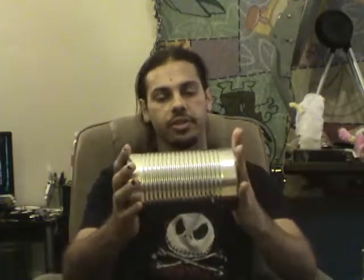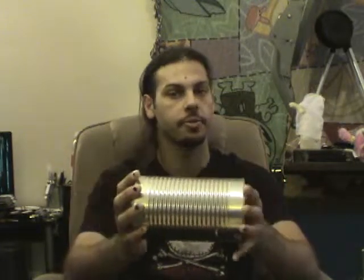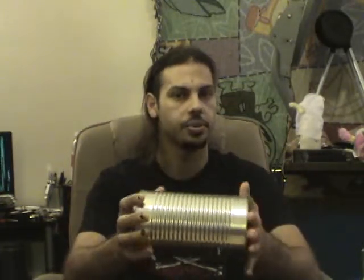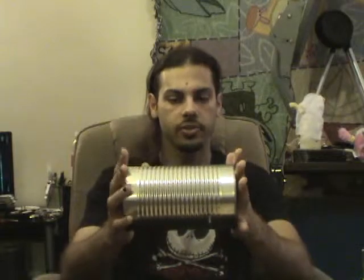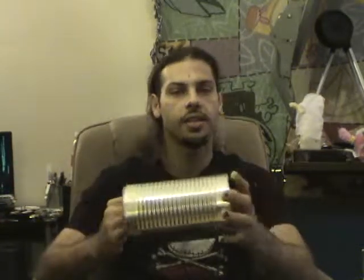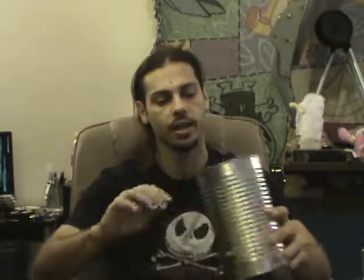The reason it's called a waveguide is because when you have a tube, even coax for that matter, electrically it is a conduit for RF signals. That radio signal is going to actually bounce up and down inside of this metal tube, and reflect up and down until it finally gets to a driven element, some kind of receiving or transceiving element.